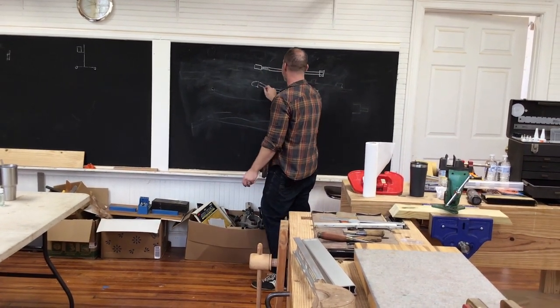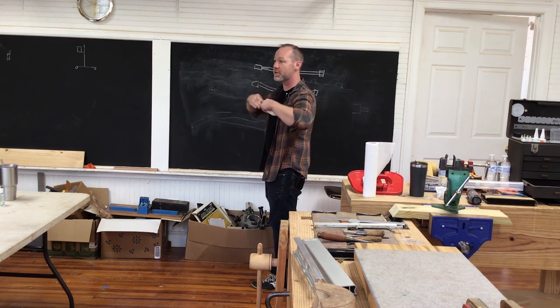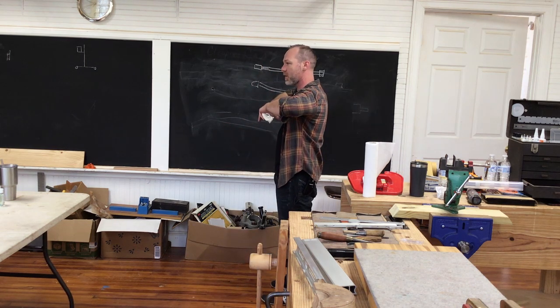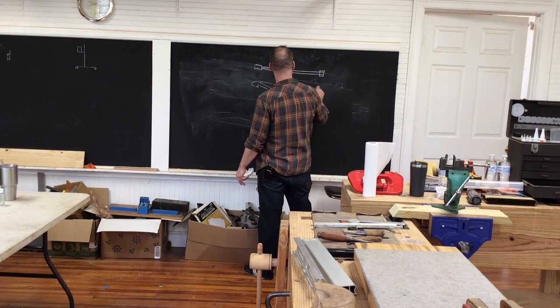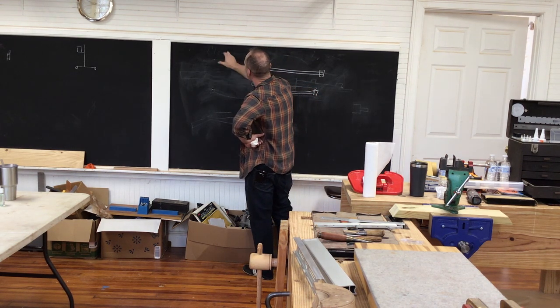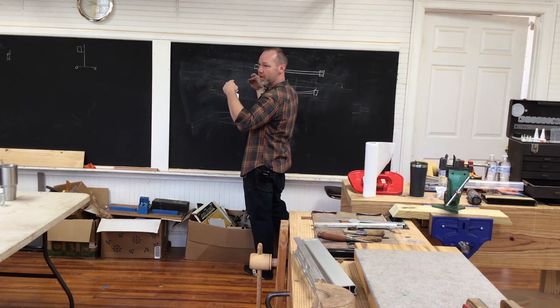And of course, the neck channel that you cut is the arch. That's what forces it into the arch. You haven't bent the actual rod, it forces it down in there. And then you glue your top strip on above it, and so that's how a compression rod works. Since it's angled, when you tighten it, it wants to straighten out.